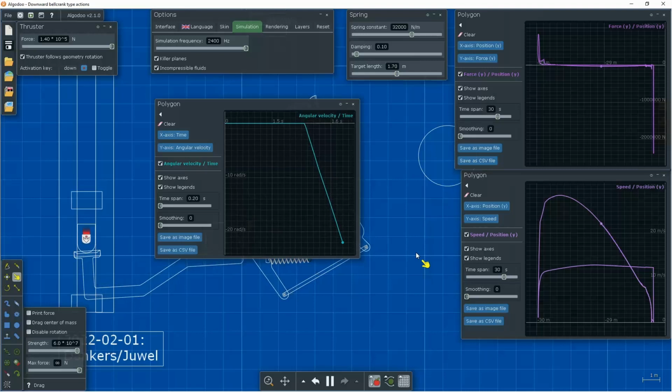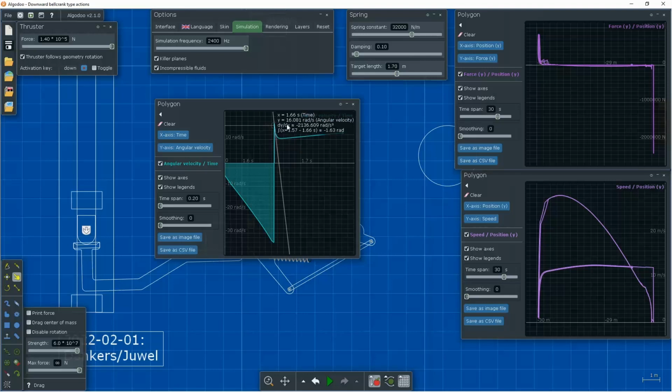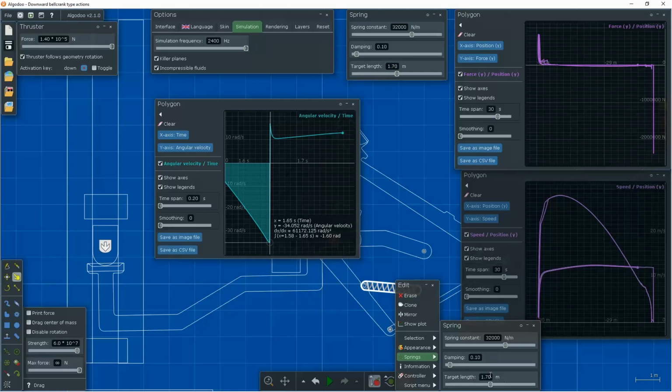So again, as with most machines I've simulated, regardless of your force curve, the type bar itself is actually accelerating at a constant rate. And in this case, what I've found is that whether or not this is increasing or decreasing really just depends on the strength of how I've set the spring coefficient or its starting displacement.